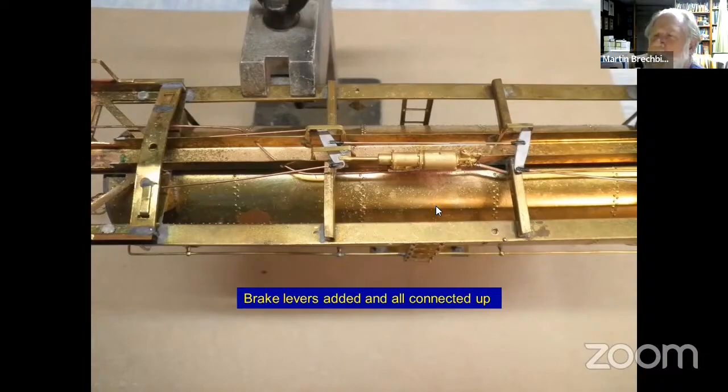John Sethian had the same experience, really, pretty well-known, good O-Scale modeler. And he has his own thoughts on the science behind it, being an engineer. So it seems to be a very nice way to connect dissimilar materials together, particularly if one of them is wood and it's end grain of wood. So I think it just gets into the porous surfaces with the goo, latches on, and then gives it a good anchor for the CA to bind into. But it's a very rapid and very strong bond.